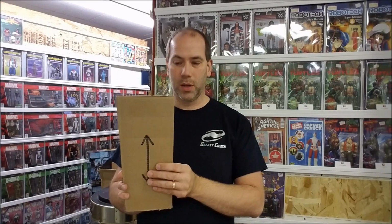If I was using top loaders that are 11 inches and I wanted to do the slidey thing, I would make them 11 1/4. If you're doing the 3/4 inch on top with the 1/2 inch on bottom, where you want to lift the books in and out, have them be removable, you add 5/8 inch. So for example, the CGC books are 13 inches tall, so I made this one 13 5/8 inches tall. The new display that we're doing, I'm using top loaders, and they're 11 inches tall, so this is my top loader removable, and I cut this 11 5/8 inches tall. And that's pretty much it.